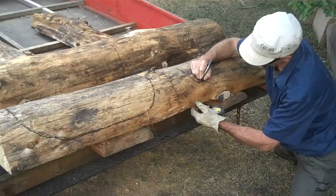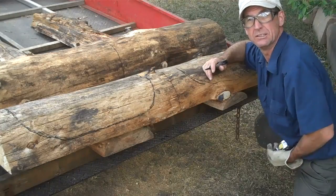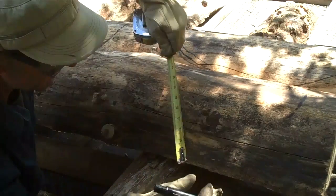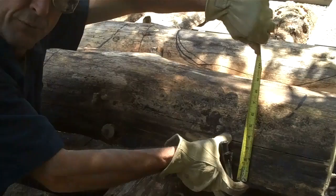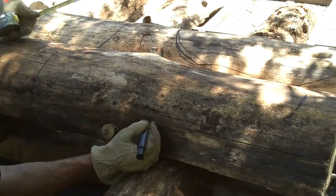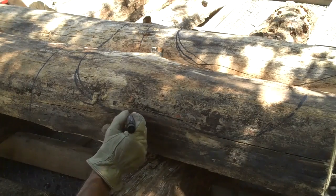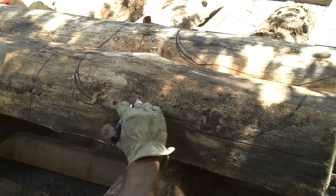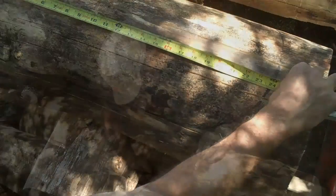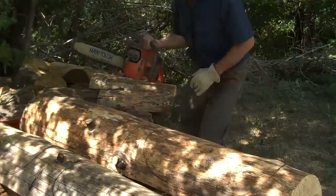I'm drawing these out on one log — it's two chairs, and we'll cut them in half after the fact. It's just a lot easier to carve these out in longer sections. Now we're drawing out the log that will make the seat. You want it to be thicker and wider in the front, and in the back — that's what gives the taper. We come up about three and a half to four inches, make a couple of reference marks, and draw in your radius. That curve creates the tractor seat effect, leaving us a nice wide seat almost 24 inches across instead of the standard 18.